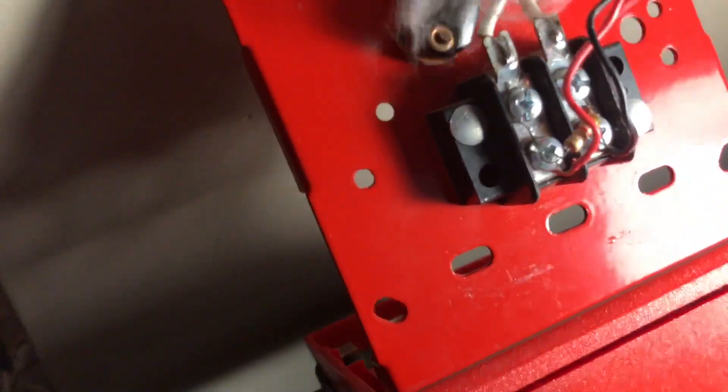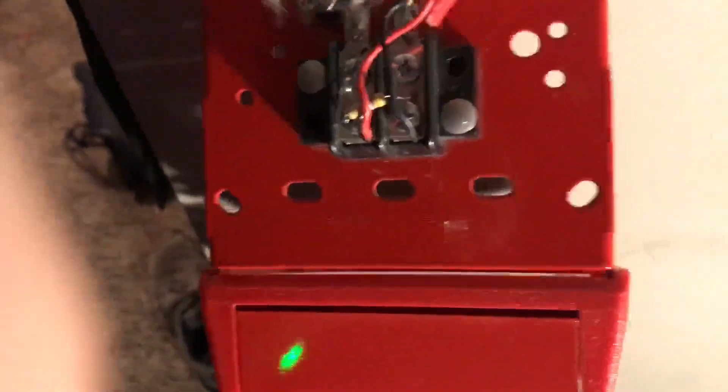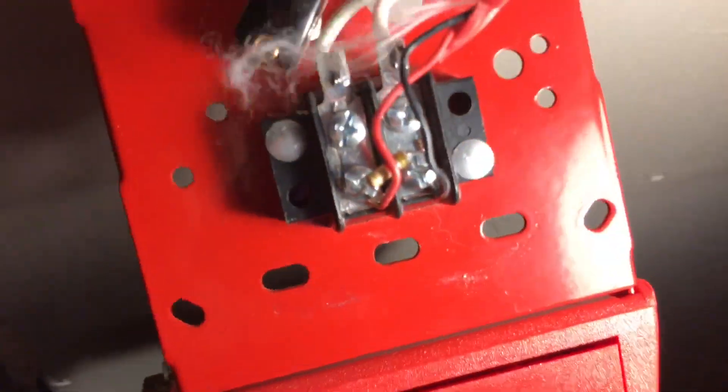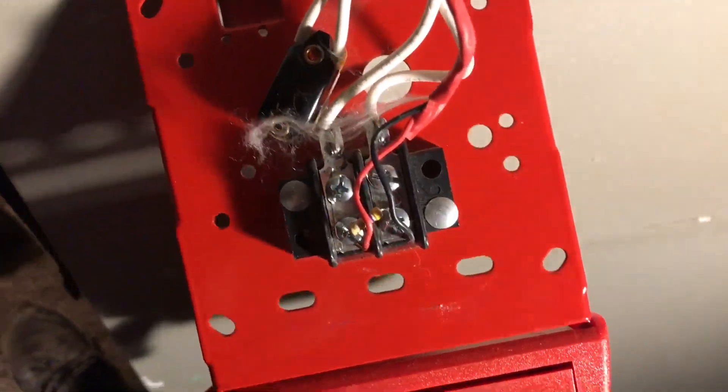I have zone 2 disabled just to see if there's anything loose on this Firelight BG10. I'm going to grab my lamp. You can see that the pull station looks wired up correctly — it doesn't seem loose or anything. I just took it out of the back box and didn't touch the terminals. Nothing's loose on it, so it could just be a faulty pull station, but we're going to go ahead and replace it.